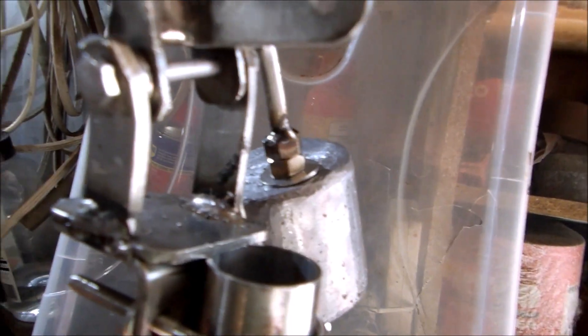The head of the vane must be able to rotate to set the course heading in relation to wind direction. I had to use a three kilogram counterweight due to the space restrictions in my setup. It is always better to use a smaller weight and a longer balance arm wherever possible.